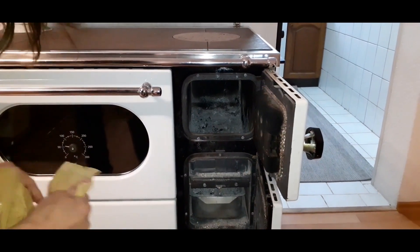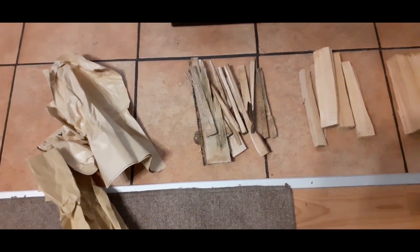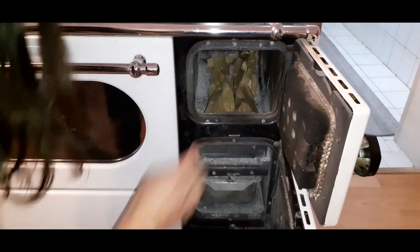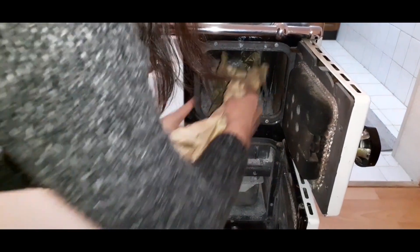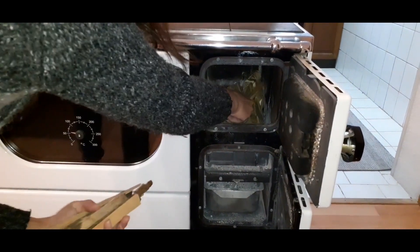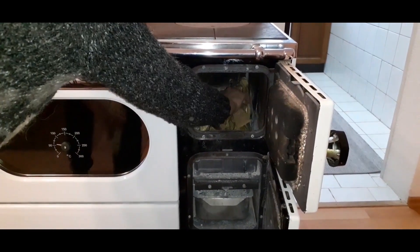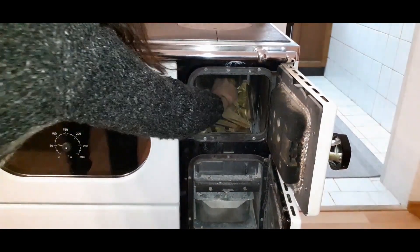Next, stack the kindle and wood inside the firebox. In this case, old paper and wood chips are used for kindle. You can buy prepared kindle if you don't want to make any yourself. The main thing to know is that the kindle should be dry and easy to set on fire. Instead of paper, you can use old cardboard or buy products made specifically for this purpose. Also, don't stuff the firebox with the kindle — stack it so air can flow around it and let the fire start easier, otherwise it will just smolder and turn into char. We would recommend from experience to crumple a few pieces of paper, put wood kindle above it, and one smaller piece of wood on top of that.